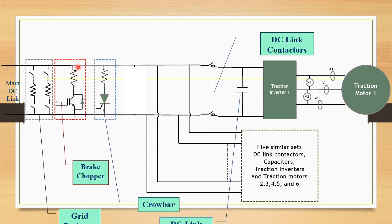If the voltage is more than 2800V and less than 3400V, then from the LCC — Loco Control Computer — supply comes to the SCR gate. As soon as the SCR gate is supplied with voltage, the SCR starts conducting and the excess voltage drops in this resistance, allowing 2650V to travel further. If the voltage is more than 3400V, the SCR is fired not through LCC but through a hardware circuit of the SCR gate. That firing is called hard firing of the crowbar.